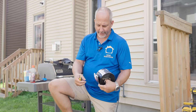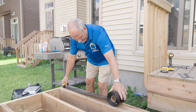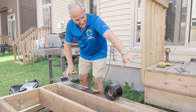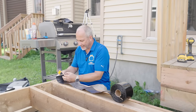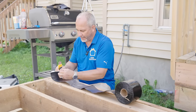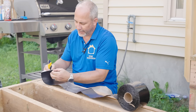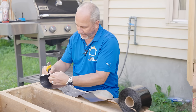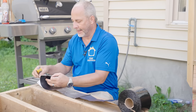It's a one-sided goo. At the end of the day, because I'm making all this flat stock here, because I'm gonna do the picture frame, it's going to take forever to dry. Water is gonna get held here and trapped here. And so it will be the first place of the deck that rots out. So what I'm doing is I'm adding the joist tape in this area only.